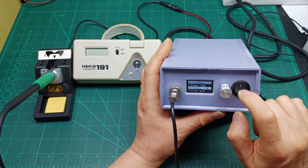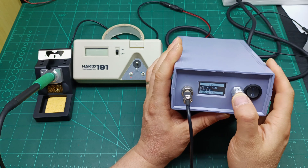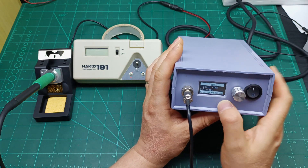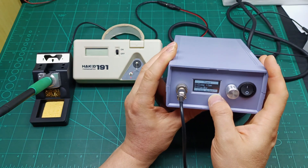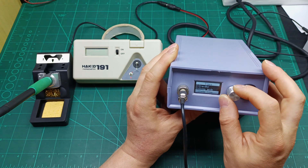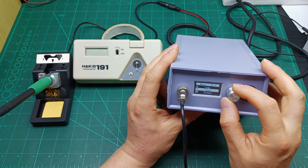Then you go to Sleep Mode. You can set it to Manual — putting it into sleep mode manually — or you can set it to Auto, so it goes into sleep mode automatically as soon as you touch the stand. Set it to Auto and press once to memorize it, then a long press to exit the menu.